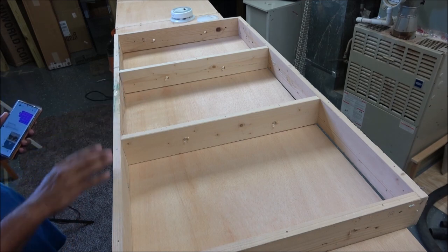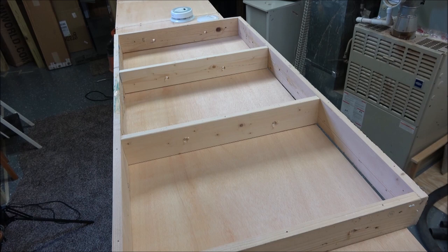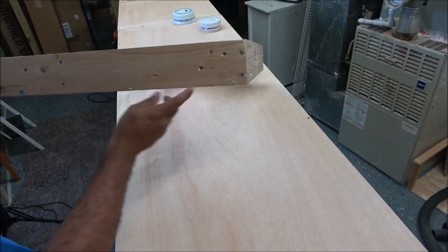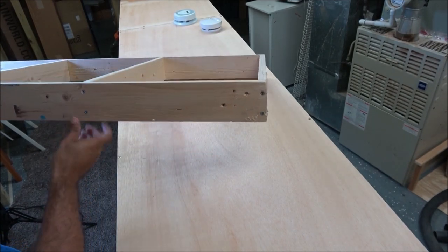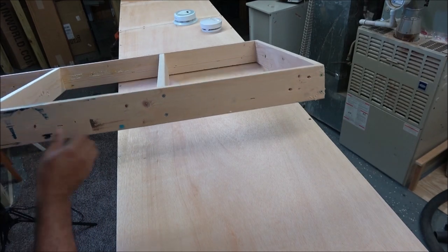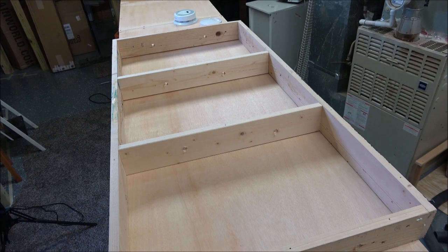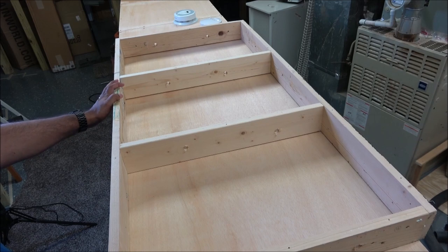You're going to do one-by-fours and construct this so there are at least a couple of braces in between the two-foot by four-foot module. You're also going to want to use number six or number eight general construction screws, with length no less than double the thickness of the frame lumber. The longer the screws the better — about two and a half inches or even three inches. Each support at each end has screws holding that in so you have a nice good foundation.